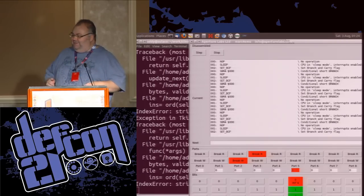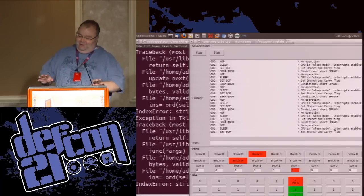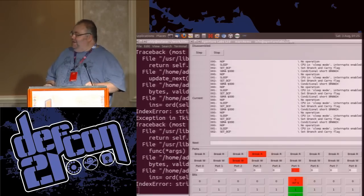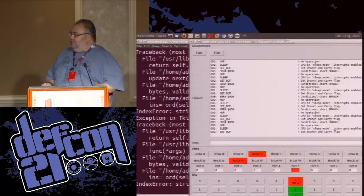There's no way to read it out, because with flash you have the ability to read it out, but here it's mask ROM, so you don't need that facility. So it just checks the checksum. Yes, okay. Now that routine gets turned off. The interconnect between the MCU and the EEPROM, again, is all inside the package. Yeah, that's not exposed to anyone. No one is ever going to get the code off this EEPROM. And it just shows you what you can actually achieve and how woolly some of their thinking is.